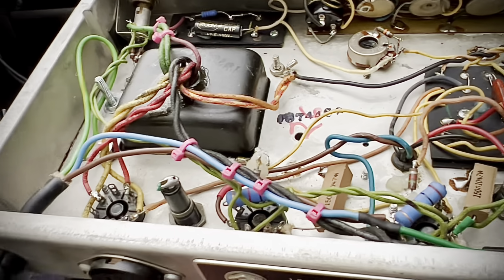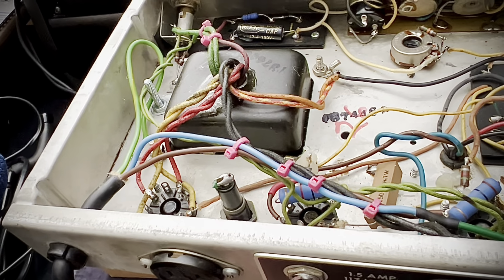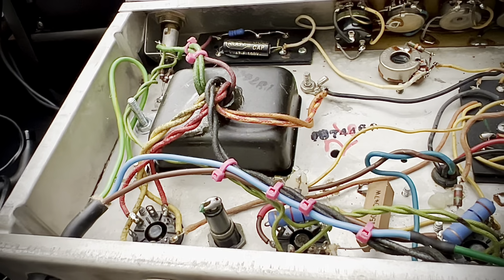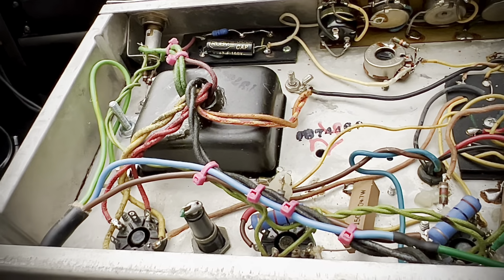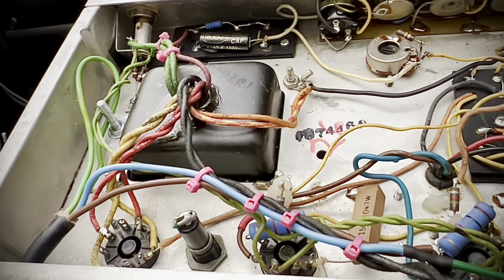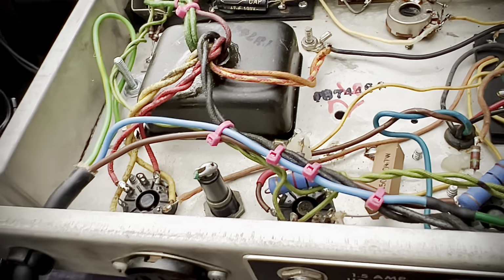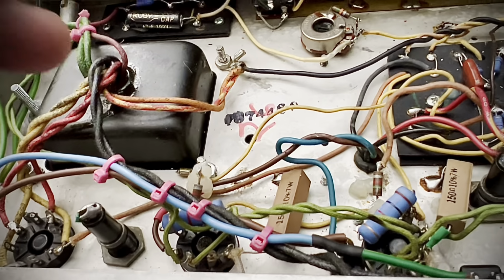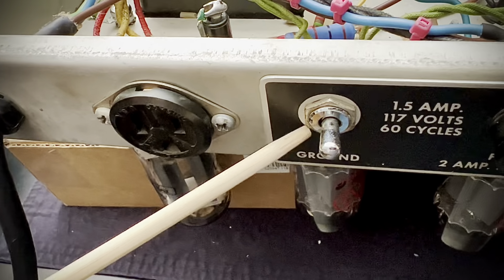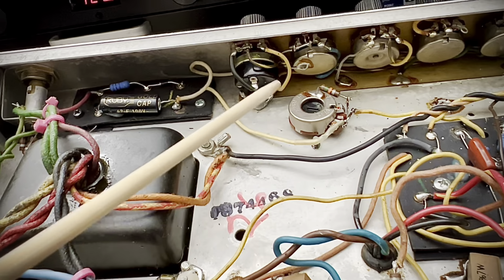See if I could work that out. But take a look. You're back to AC heaters, and guess what? That DC supply was only supplying about 1.8 volts per side. Unbelievable, right? You're back up to about 3.2, or about 6.3 going across. So nice and healthy. Your bias pot has been relocated from the ground switch here, position back to where God intended, or at least Leo intended.